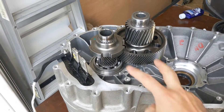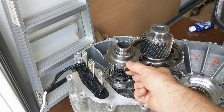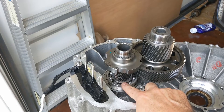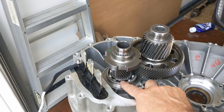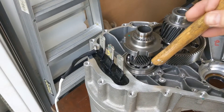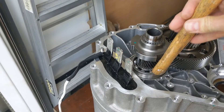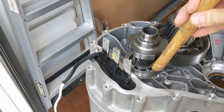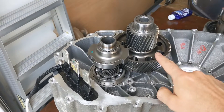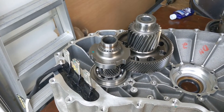We start the assembly with both shafts simultaneously. For the Toyota RAV4 and the Mercedes-Benz we have this disc that's in the way. For the normal Tesla you can start with this shaft on its own and after you've hammered this in you can do this shaft also. How I hammer it in: I put pressure on the outer race, which is better for the bearing, so I alternate from both sides until it's in halfway.